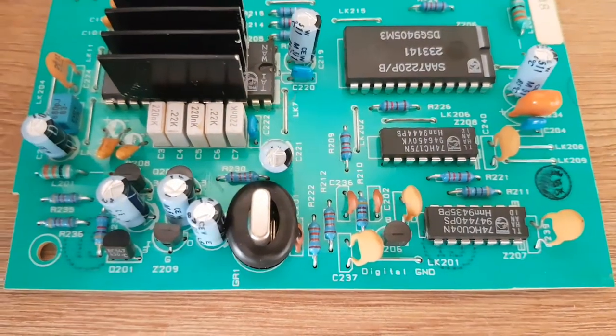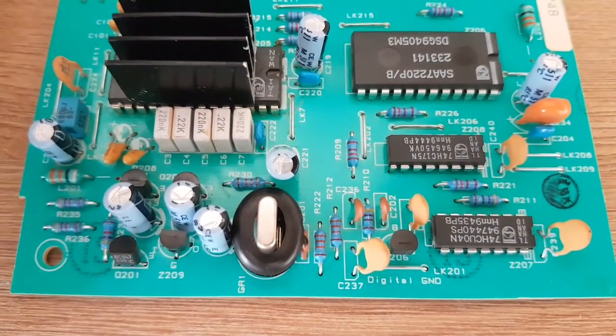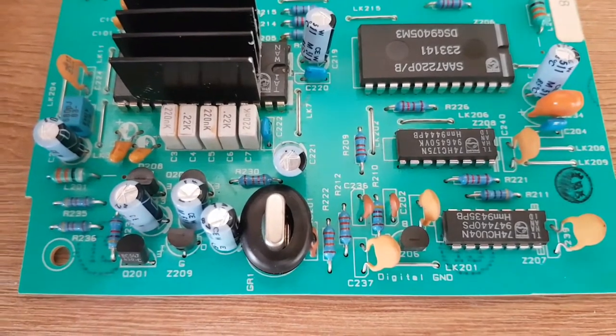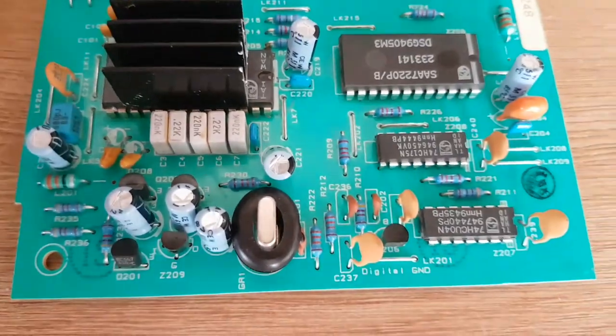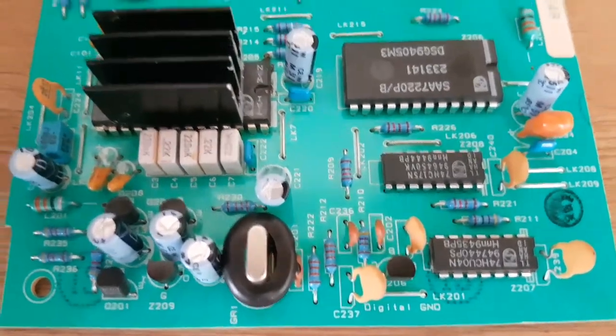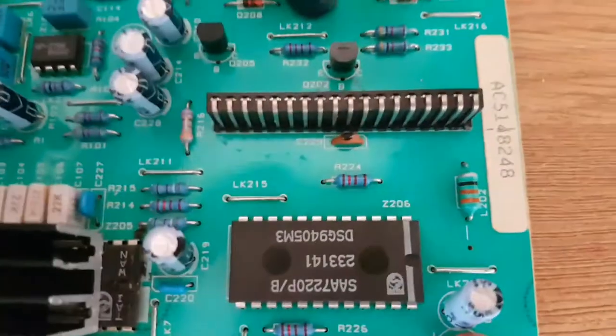It's very good actually, but I'm going to be putting an external power supply to it so that it will be powered on its own. Now, if I wasn't going to be doing that, I'd be cleaning all the capacitors up — which I'm going to do anyway — and I'd clean up the power supply to it. There are some chokes there which are doing a good job.